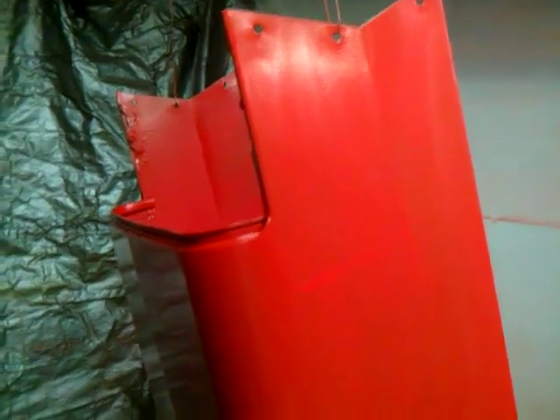There were a little bit of orange right there on that but we didn't get them all the way. There's a spot right there — I don't know if something was on it, a sticker or something at one time from the metal, cause we had a hard time painting it. But there's just the first tack coat. They call this a tack coat — you don't want to put it on too thick. There are some spots here and there; I don't understand what's causing them. It's probably the same thing causing that in there — maybe the primer had a run in it and we sanded it out.